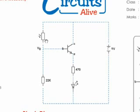When it is dark, the LDR has a very high resistance of about 2 megaohms. When there is light, the chemical coating on it will be agitated and reduce the resistance to between 0.4 to 20 kilohms. So in other words, when it is bright resistance is low, and when it is dark resistance is high.